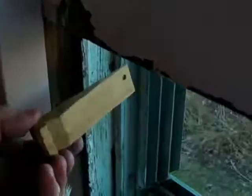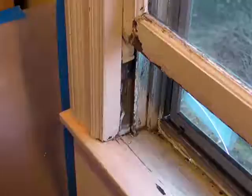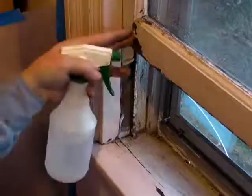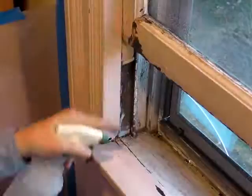I'll do this work leaving the sash right in place. First I'll just wedge it so it doesn't slide and slip around with these little wooden wedges, and one wedge up here at the top as well. That'll hold the sash steady while I work on it. For lead-safe operations, I'll mist down the work area, which will help control the lead dust from scraping right here.